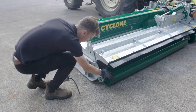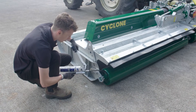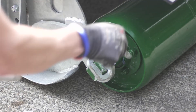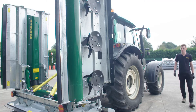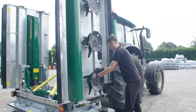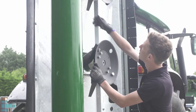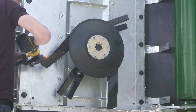Check the roller according to the user manual. Grease the roller ends after every 40 hours until grease is visible at the wiper seal. There are four blades per rotor for powerful mulching. Blade assemblies and components must be checked on a regular basis according to the user manual. Sharpen the blades using a small grinder.